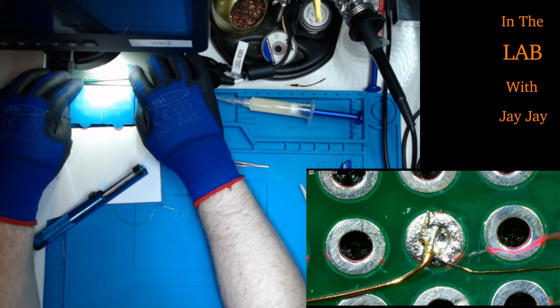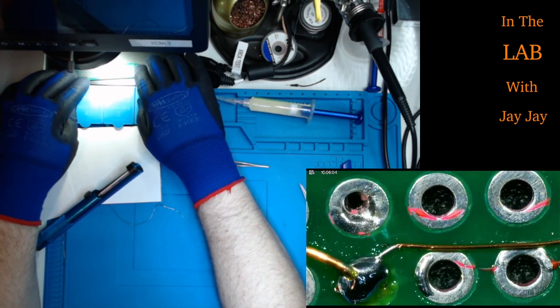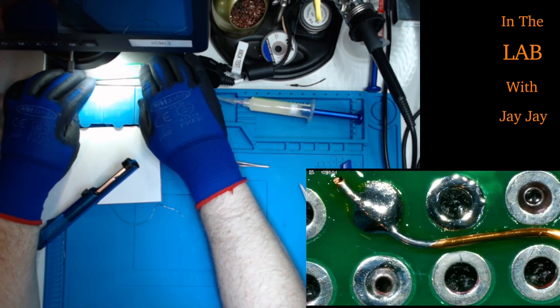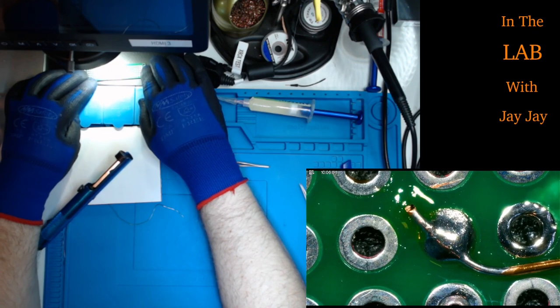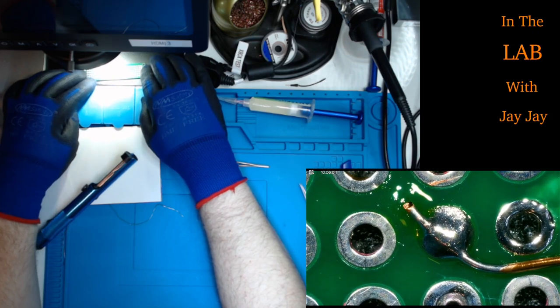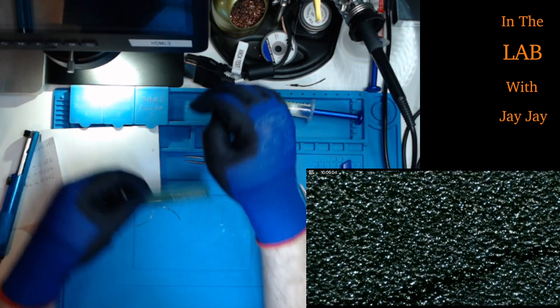And then this is the second joint. I'm going to redo him. I'll reflow it. Extra flux, extra solder. But it looks fairly good mechanically. And then follow this guy over. This is our third joint. Oh, that looks really quite kind of terrible. So we'll reflow that, we'll reflux it, we'll get plenty of solder in there. And this one over here looks like we could actually do a better job with the cut. It's too long, so we might hit that with the tin snips maybe, or the cutters.